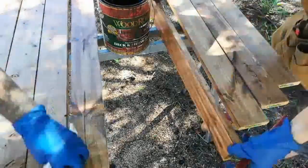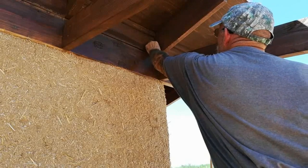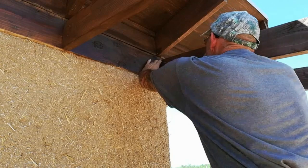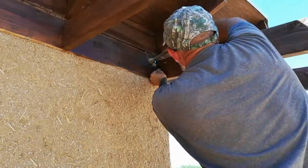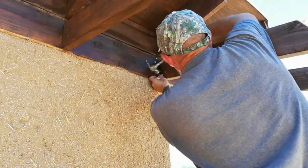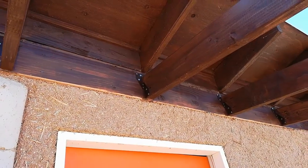This was certainly a lot easier than trying to stain them after the purlins had been installed. Here I'm installing Simpson rafter ties using inch-and-a-half galvanized roofing nails, and one was installed on each rafter. So I've got these hurricane ties or rafter ties from Simpson installed on the solar shed.